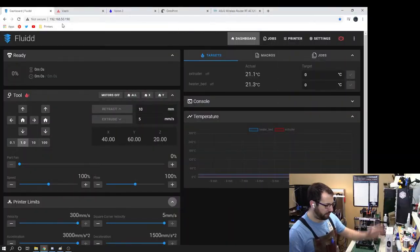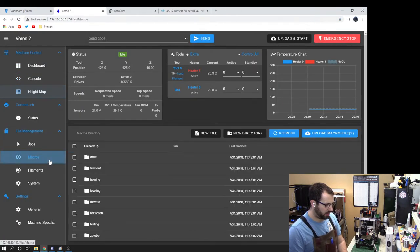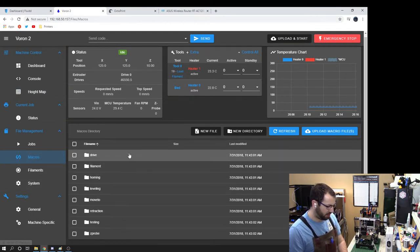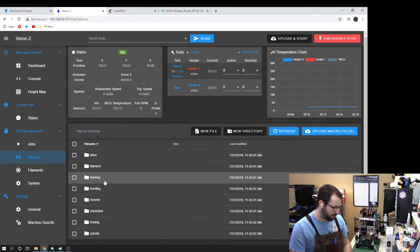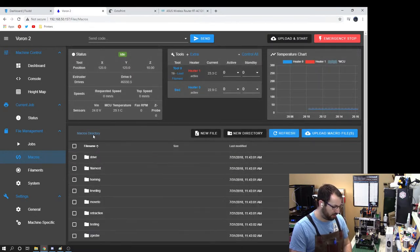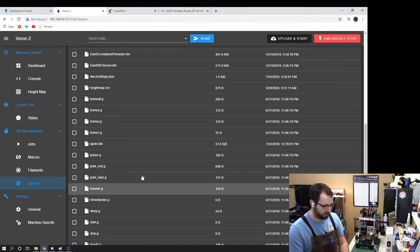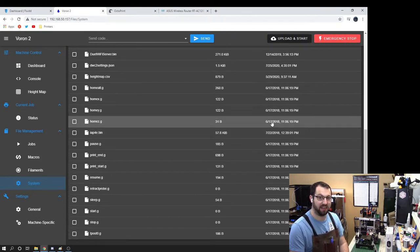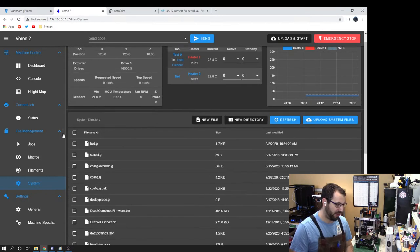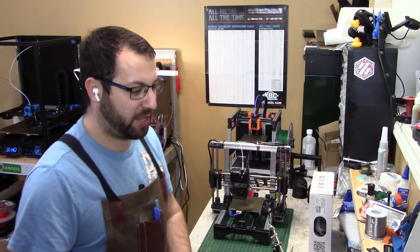So anyways, enough about playing around with everything. Don't get me wrong, I do like RepRap firmware, but for example, configuration is why RepRap is kind of a pain for a V2, because everything is nested, with macros and scripts to make everything work. As you can see in this configuration, we have files in here from 2018. I got it working and I stopped messing with it. I've updated steps and motor direction when I've done rebuilds of the V2. So it's got some bones on it.